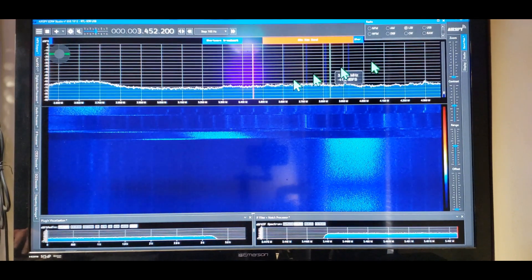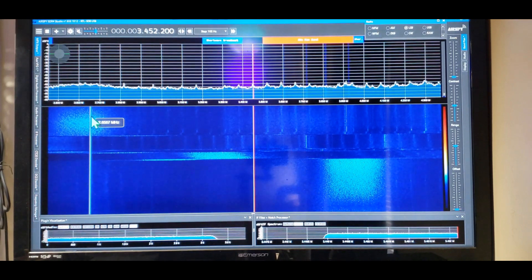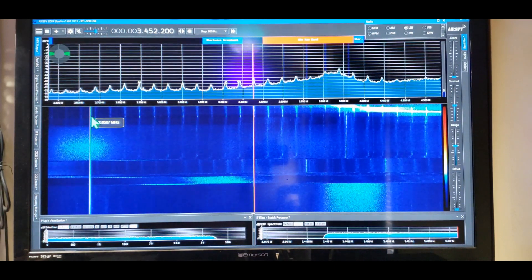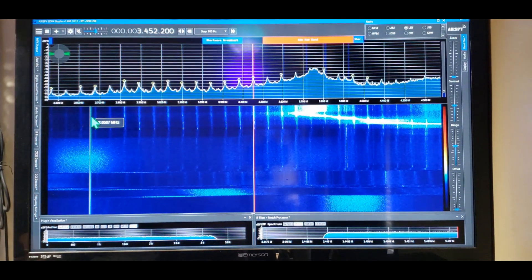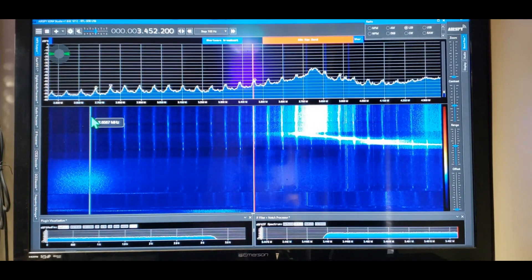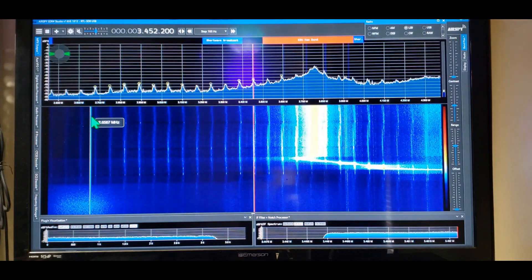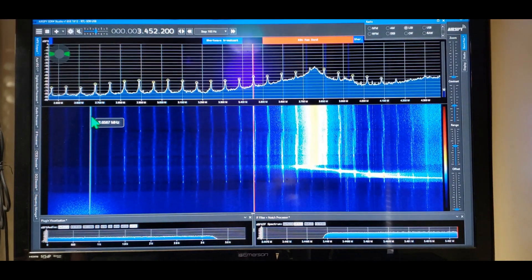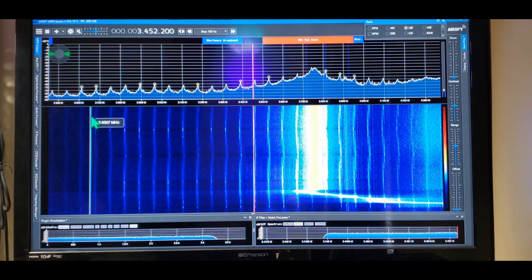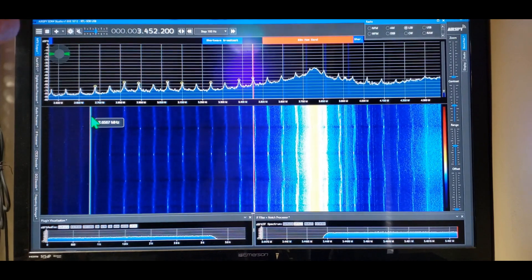Right there at 80 meters we see a little bump. Let's go to the capacitor and turn it... looky there! So our 10-to-99 pF capacitor with this loop seems to be showing resonance at 80 meters. It seems like every loop antenna I build resonates down on 80 for some reason.